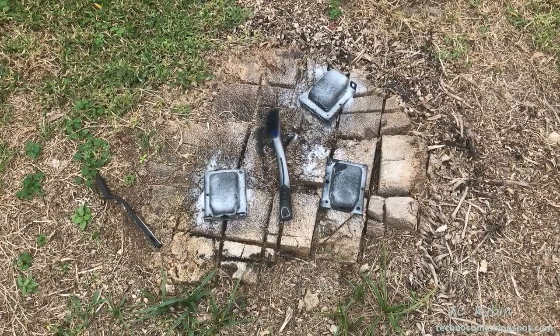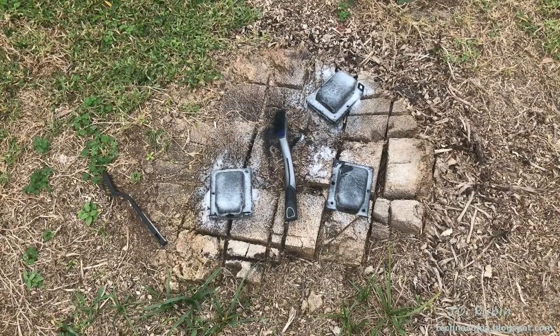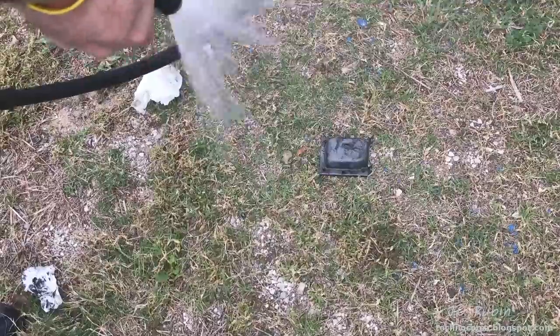The first batch of paint didn't go too well. It was simply too windy, too much dust in the shop. I'm stripping them down. I'm gonna repaint them. No harm, no foul. Also, I didn't want to use a primer-painter combination. I'm gonna separate primer and painting.